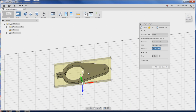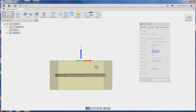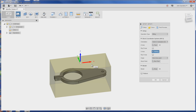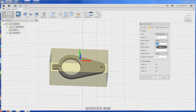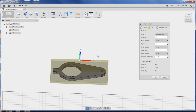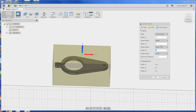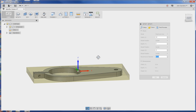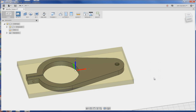Setup - we want to choose orientation, Z axis, and you just click that plane. It changed my stock though. Depth of Y: 0.5 - oh that's Y. This is 5 and that's 0.5, so that puts us right in the center of the part which is perfect. Click OK.